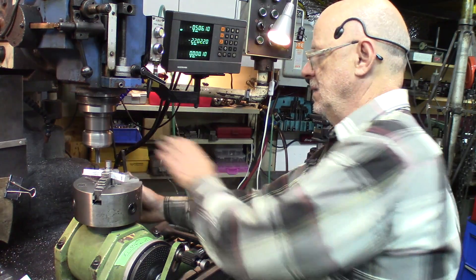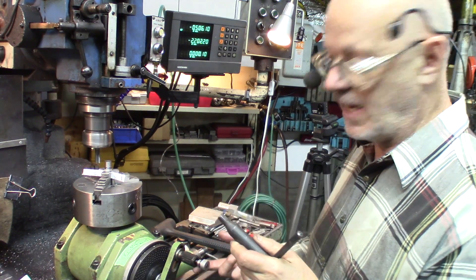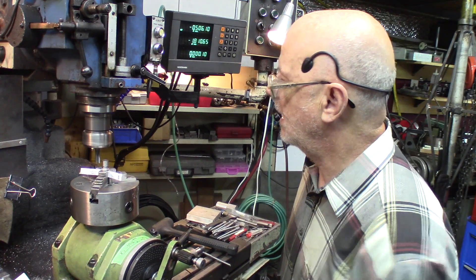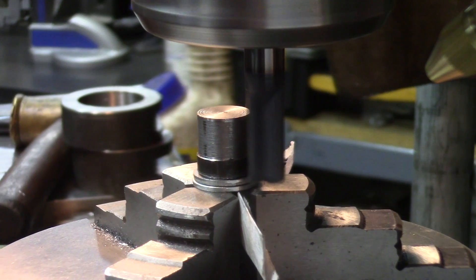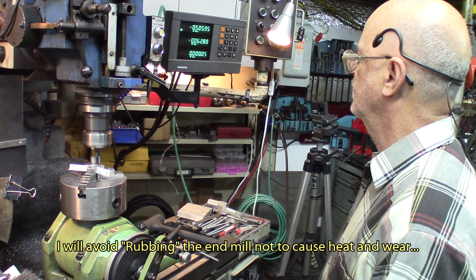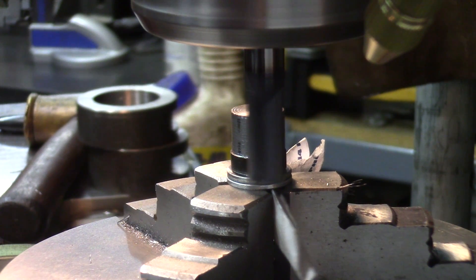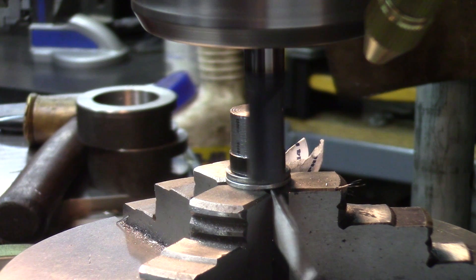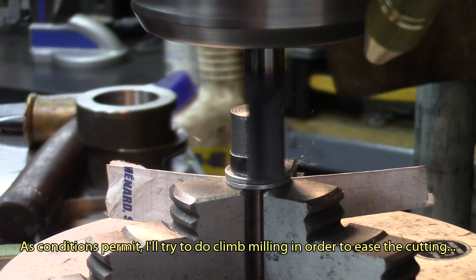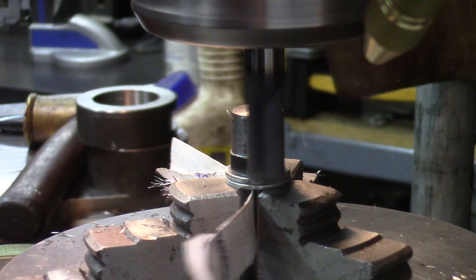506 is going to be good enough. This is tight — it's not dangerous like the lathe; if you can run the handle fast enough to injure yourself, you're good. I'll zero this axis, get this lined up with the zero axis. Half a thousandth — good enough. Let's turn the head. There we go, we're milling a nice round surface on this.